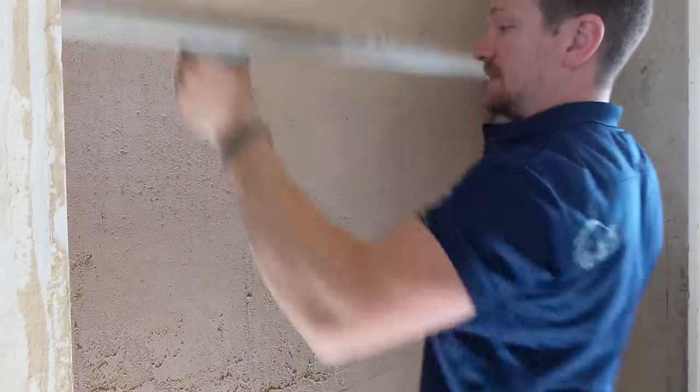It's been about 20 minutes and the process from now on is very simple. I'm going to give a bit of water to the edges with my brush and then we're just trowelling out. Lime plaster is actually very forgiving — when you wet it up it can come back. It doesn't stay as stiff as a gypsum plaster which will set when it sets. The lime plaster is quite nice to work with in the fact you can just bring it back — you don't have to worry about it flash drying all of a sudden.